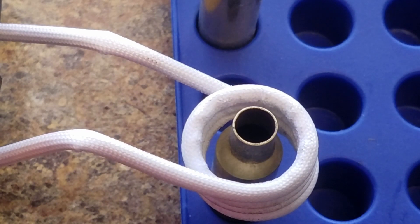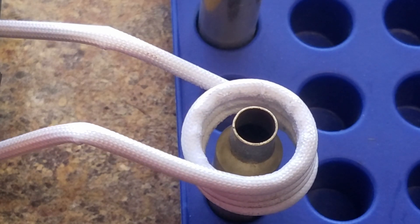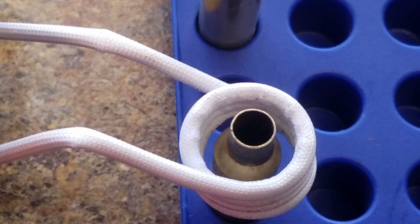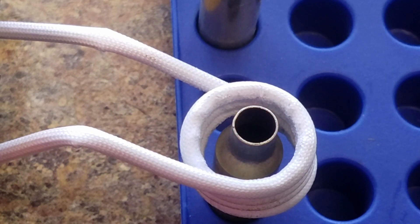You don't really even have to do it in low light to get the annealing that you need. On the next cycle, you're going to see a little flash of gray, and after that gray is when it starts turning dark red. There goes the gray — and you can just barely see it start to go dark red. That's all you need right there.